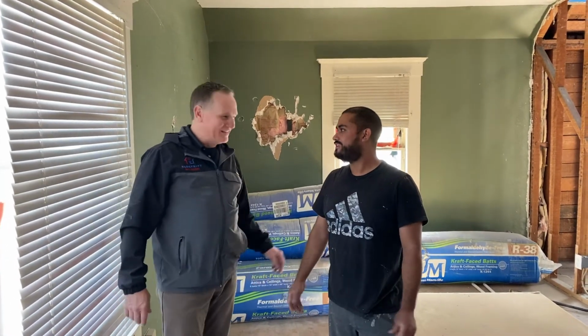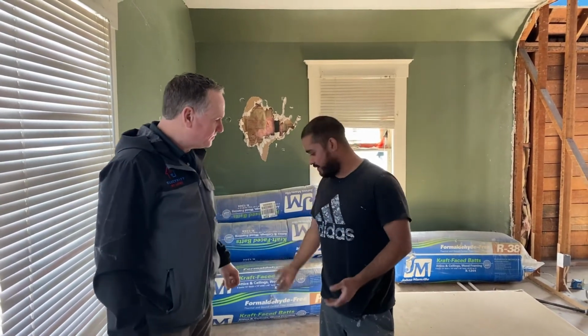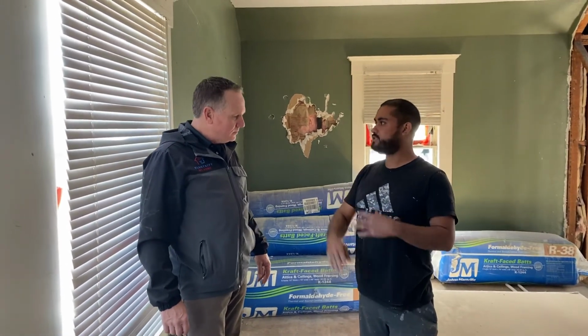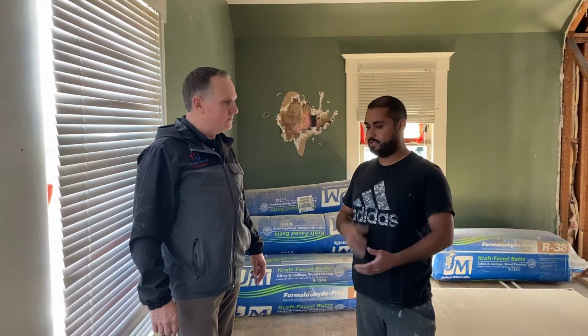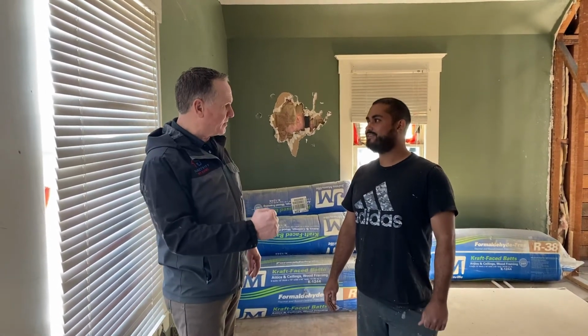I don't want to say that's the smartest thing I've heard all day, but that's the smartest thing I've heard all day. Because some people grab insulation from a duct and stuff it in there, but that's not going to do it because insulation isn't airtight. Air is going to go through it and evaporate the water in the air sealer and dry it out. And then it just becomes a bucket of useless rubber with a handle, because there's always a paintbrush stuck in it.